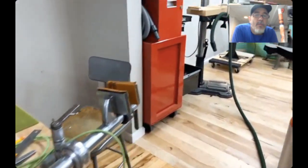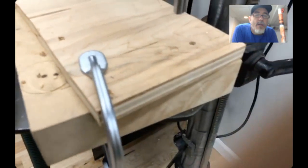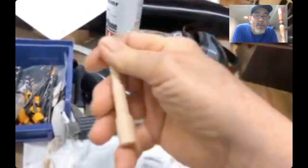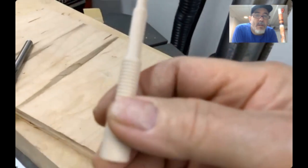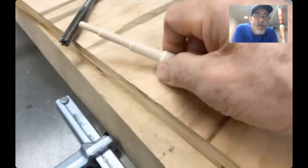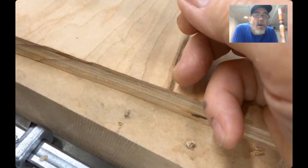When I get on something like this I drop everything — sounds like you're the same way. Here's where I was drilling and reaming out the peg holes yesterday to get a nice clean joint. Look at the mess that follows. I'm constantly yelling about my optivisors. These dowels I made on the lathe are the most incredible tools for furniture making — they're stepped, and there's a step drill bit that goes with them, so when you're joining something together you have three different diameters.